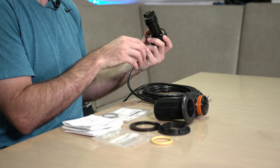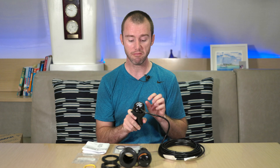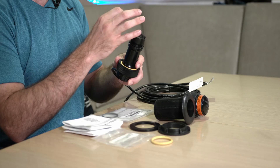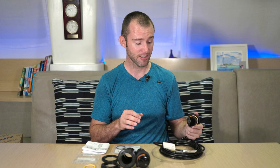This is the transducer — Airmar DST-810, so at least I'm talking about the right thing. We've got the paddle wheel here on the bottom. Brand new, moves so nice and easy — I absolutely love that. This little paddle wheel can work at 45 knots through the water. We've never had Starry Horizons anywhere close to those speeds, so unless you're in a super fast motor yacht, I think you'll be fine. This is the part that's now working at five times per second for your speed-through-the-water data.